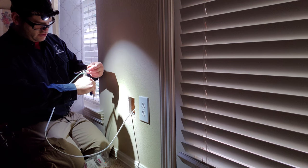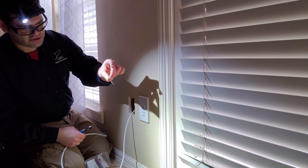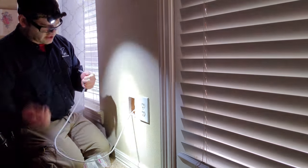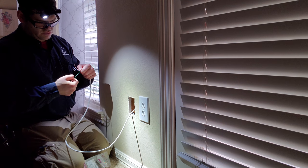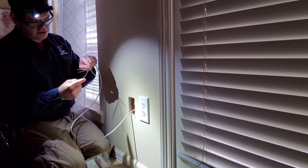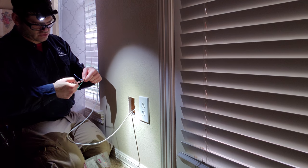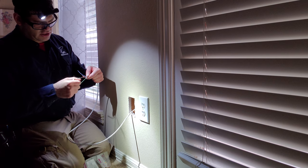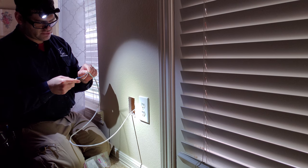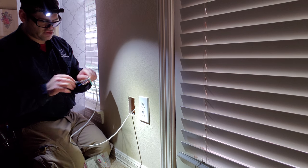So we're going to cut off the fiber that goes through there, the string, as well as the plastic divider. You want to unwind the four pairs in here. You have white with orange, white with green, white with brown, and white with blue. Of course, there's an A and a B standard. Most people do B standard now, which is what we do.